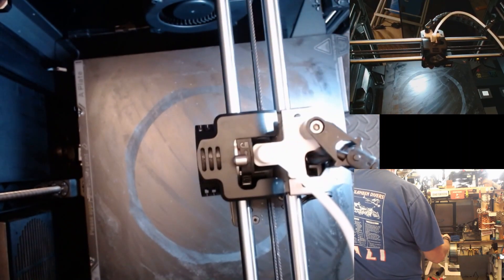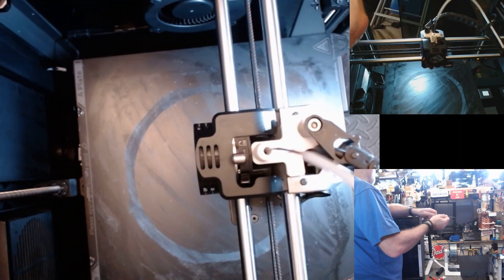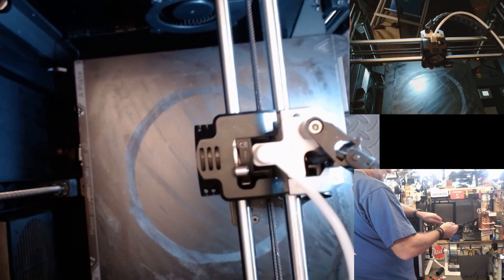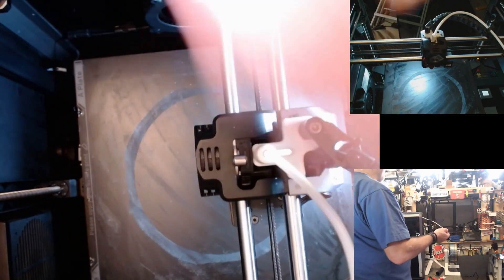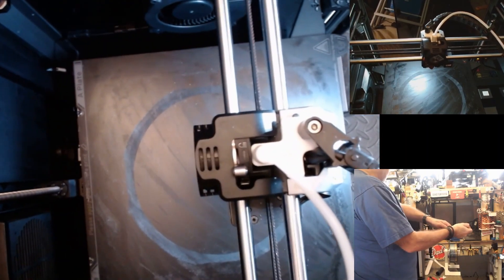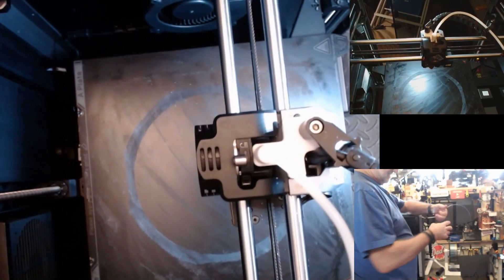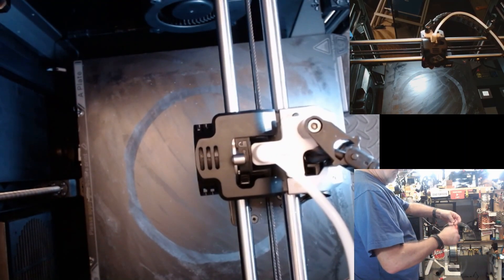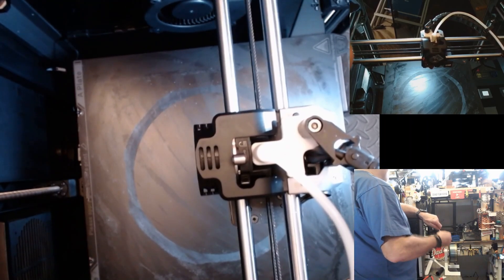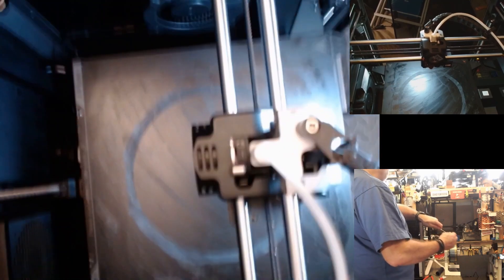It's going in at a straight angle now. I'll push the filament back in. The clip doesn't clip properly — it went in place, but when it got to the end it started pushing my Bowden tube out because the clip's not working very well. I might have to put a new clip in there. Pull the filament out and try pushing it back in again. It's done that again — damn it. Lock it in place. The filament's in.